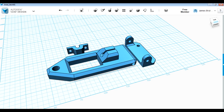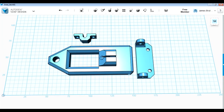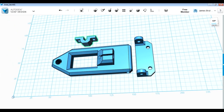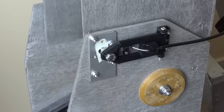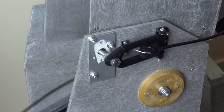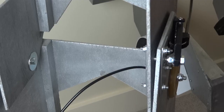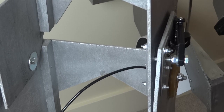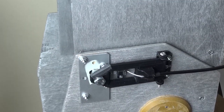Here's the next part we're going to print, which is for the knee latch. At the moment there's a bolt which I put in and take out by hand - that bolt is going to go through the hole at the pointy end. This piece latches onto the base which is screwed onto the chassis of the Hulkbuster, and there's a little clip that turns 90 degrees in two directions and goes in the hole - that clamps the cable. It's basically a cable clamp for the end of the bicycle brake cord, which should allow me to push and pull the bolt remotely. Here is that mechanism now - I've printed it. It's cable-controlled with a very similar cable to the boot latch. If I push the end of the cable it unlatches and allows the top of the knee to freely move, and if I pull the cable to locate the hole it pulls back in again. I probably need to have a spring in there somewhere which holds it in one position or the other.